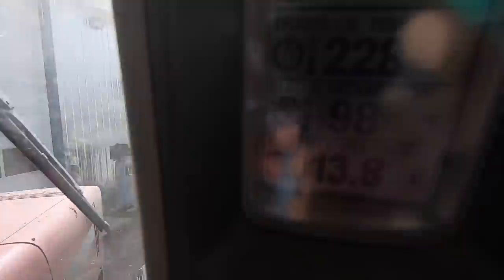I just got a warning on the screen here that the transmission temp is too high — it's at 228 degrees Fahrenheit. That's way too high, so I'm going to go and blow out the rad. I didn't think this was going to be a problem, but it is pretty dusty and there's quite a bit of crap flying up everywhere in that field. So we're just going to blow out the radiator and the air filter and hopefully that cools things down.